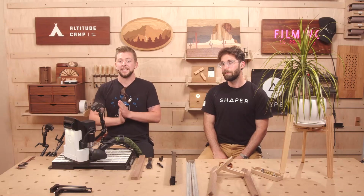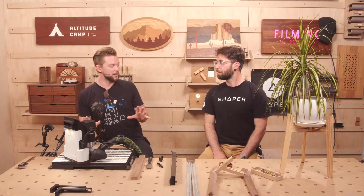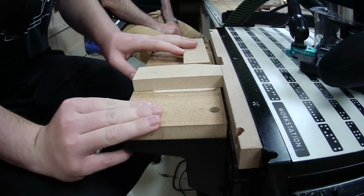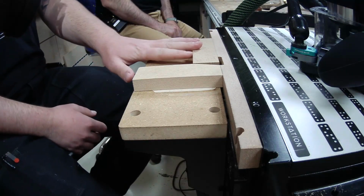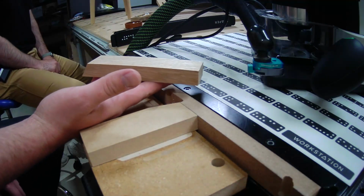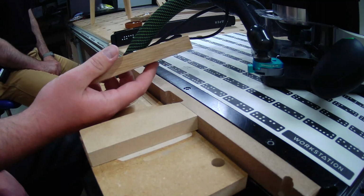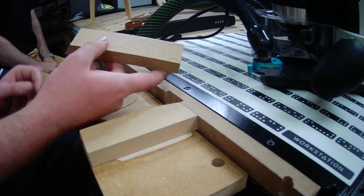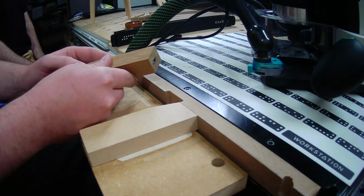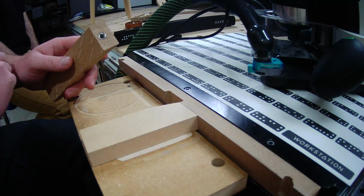All right, this whole thing is done on Workstation, which I always love. I love when a project is all based around Workstation and primarily done on the shelf. So for my stretcher, I'm set up on the standard shelf that comes with Workstation, and this is my stock. I cut it down to 6 inches in length, 1.5 inches in width, and it's all 3/4 thick. We went ahead and cut the 30-degree angle prior, just so I didn't have to run off to the miter saw mid-show. And we've already done the threaded inserts, but we'll talk about those.